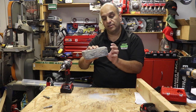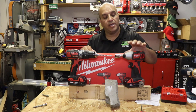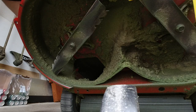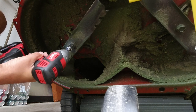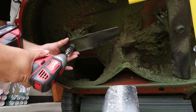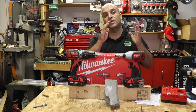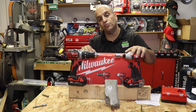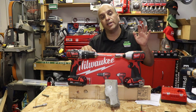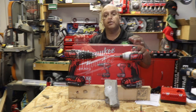As a bonus for lawn care business owners, I was curious whether this quarter-inch hex impact driver could remove the blade bolts off my eXmark commercial mowers. I'm happy to report no issue removing the blades off my eXmark Commercial 30. I looked up the blade bolt specifications on my eXmark Commercial 21, the Commercial 30, and my larger Staris stand-on mower — they all spec between 50 and 60 foot pounds. This unit at 1,400 inch pounds of maximum torque should have no issue removing blade bolts torqued to factory specifications.